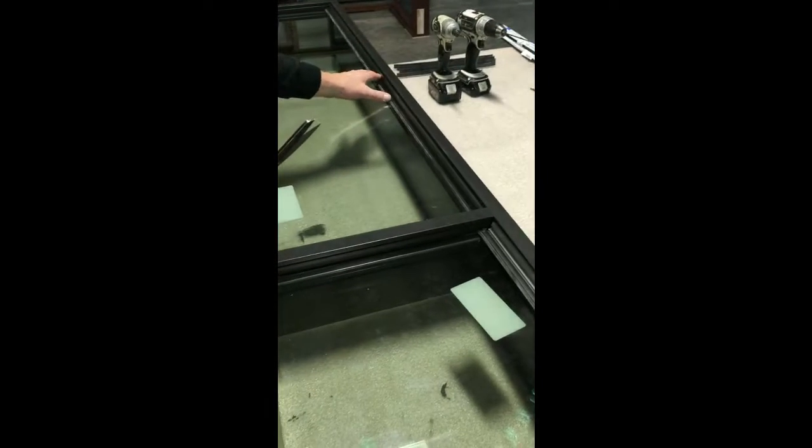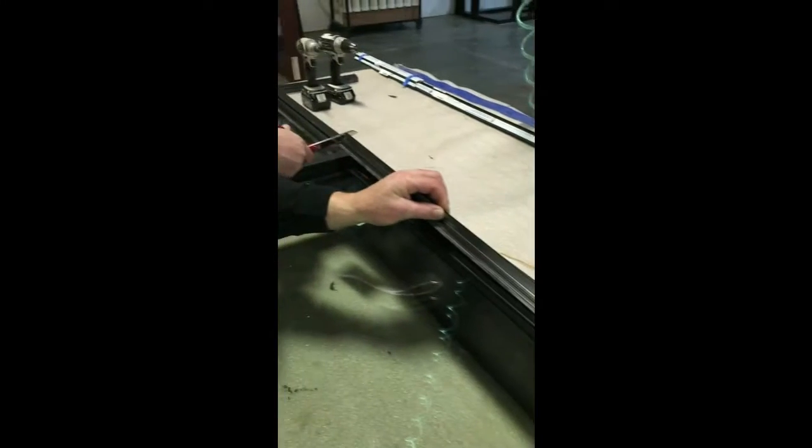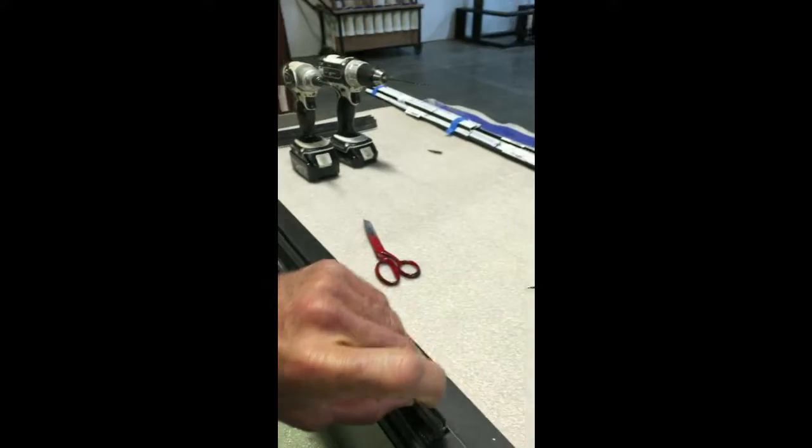So that one's just like that — we'll cut this one, about an eighth. The gasket goes against the glass, and this guy goes just like this and like this. So now what we're going to do is we're going to silicone — these get silicone on three sides.